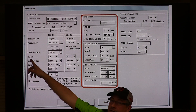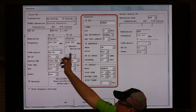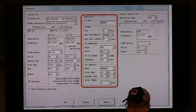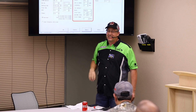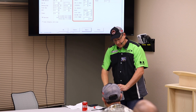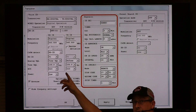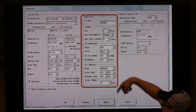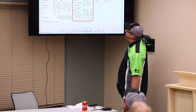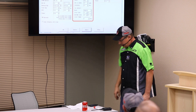DGID is your WIRES-X / Fusion squelch. You've got your channels, and you can also set it up for analog devices. Someone who has an FT-8900 or FT-8800 with that same connector on the back can use the HRI200 box to set up an analog node for WIRES. This section here covers all the fun stuff for repeater operators — setting up tail squelch and making everything happy in repeater land.